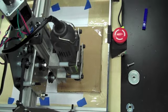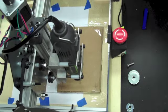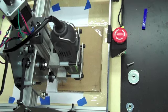So I repositioned the camera to get a better view of the machine as it cuts. I still need to establish that 0-0. There's two ways I can do this. I can cut power and move it by hand. Sometimes that's the easiest thing to do. But I think we're going to play with jogging this thing around with these software controls in order to get it where I want it. That'll give me some exposure to these controls, and just to make sure that everything's talking right.